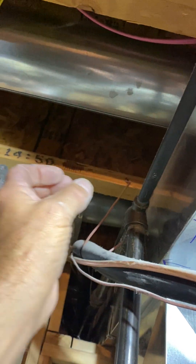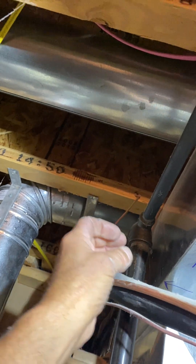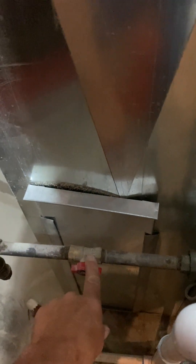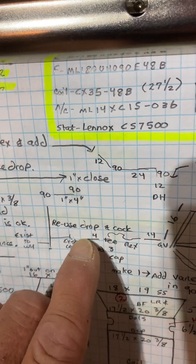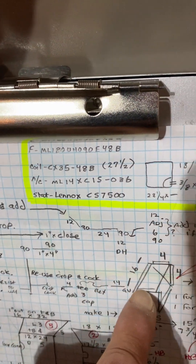You can make that four-inch piece wherever you need — if you need to go this way and then down, or at an angle and then down. Just reuse this drop, reuse all the stuff for the water heater, and reuse to this cap. From this cap you're going to add a four-inch T3 cap flex, 14 inches into the furnace.